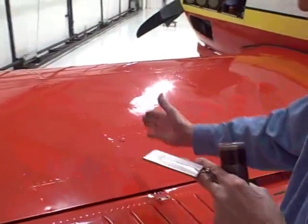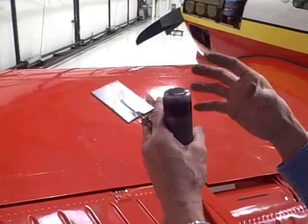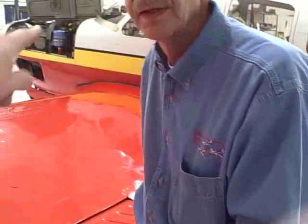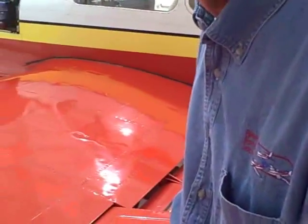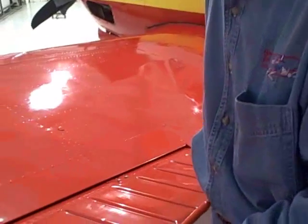There's a bell crank in here — right here — and it should be parallel with the grip. The cable rigging may be a little bit off. It'll fly no differently right now, but this doesn't have full travel. It should hit the external stop first instead of the internal stop. It should have 20 degrees up travel and we're not getting it.